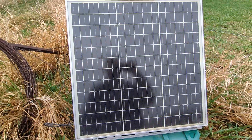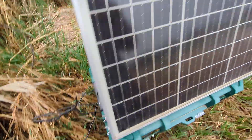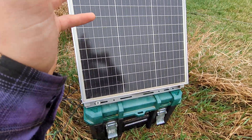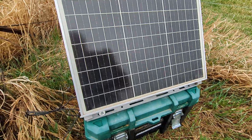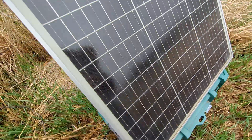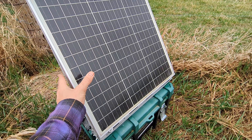Going over it quickly: this is a 50-watt solar panel, which is massive overkill, but keep in mind solar panels do degrade over time. In 25 years this thing's going to only generate about 25 watts, and that's only at peak. We've got some trees here and in the summer it won't be in full sun all the time, so I'm always of the opinion that a bigger solar panel is better. I want to say when I bought this it was about $75–80.